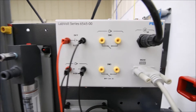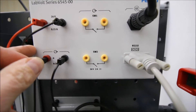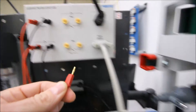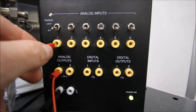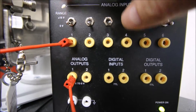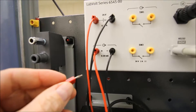In order for that 1 to 5 volt signal to go into my LV ProSIM program, I'm going to take one meter lead and connect it in parallel with that resistor. I have that 250 ohm resistor there and I'm going to put that lead into this terminal right here on my IO interface — input number 1 — making sure that the dip switch above is set for 5 volts. In order to reference the other side, I'm going to take the negative and connect it into the common.